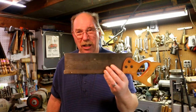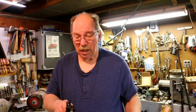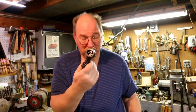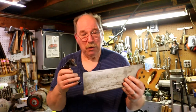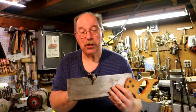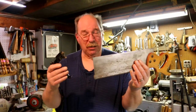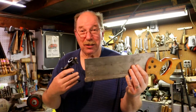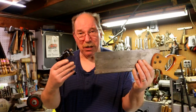When you're working with a saw like this back saw, it has very small teeth and the plunger on this number 42 is narrow. Having the narrow plunger on the saw set means I can set it over this saw even though it has 14 teeth per inch and hit one tooth. You get some of the bigger ones with the larger anvils — they want to hit two teeth at once, which makes it difficult to get a good set on a saw with 14 teeth or more. I like it for that reason.